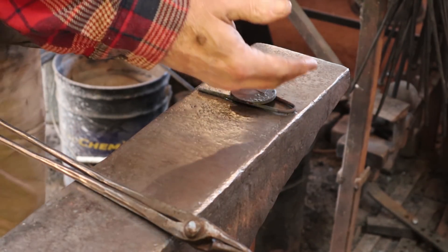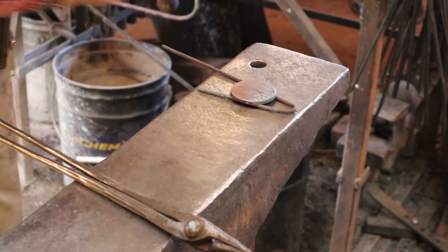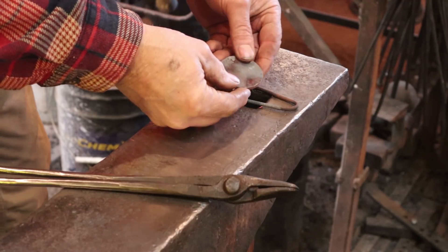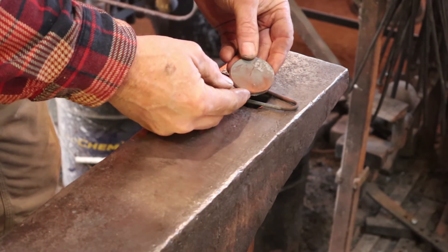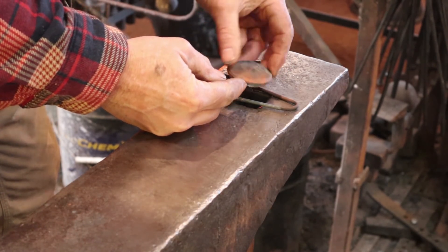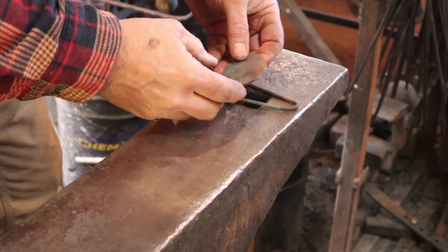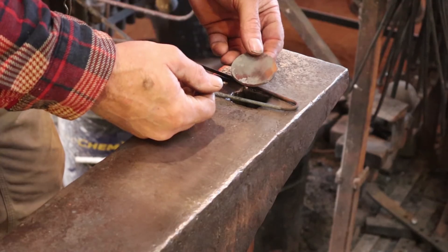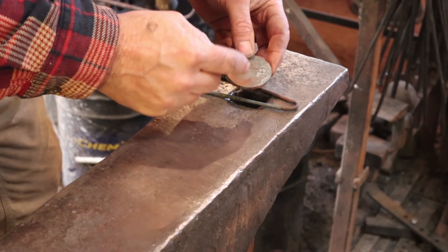It's been a few minutes. I can still feel too much heat coming off of that with the back of my hand, so it's not ready to grab yet. This has now cooled off enough to handle — it's still a little bit warm, about the temperature you would normally put it in to temper. But we're not concerned about tempering at this point; we just want to know, will it harden, and how will it harden? The next thing to do is find out: is it hard?